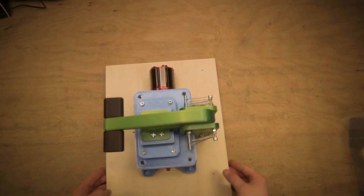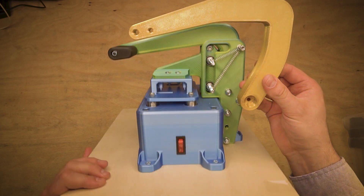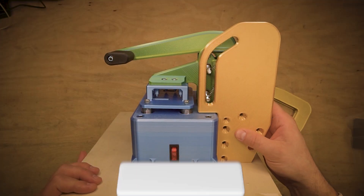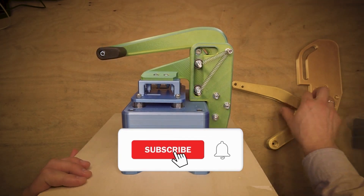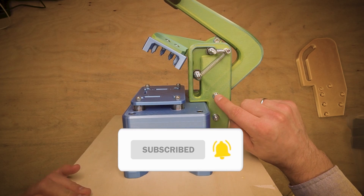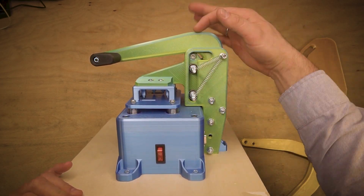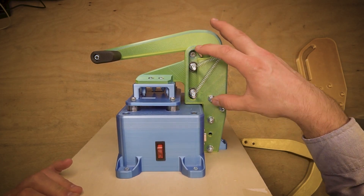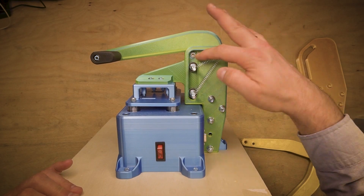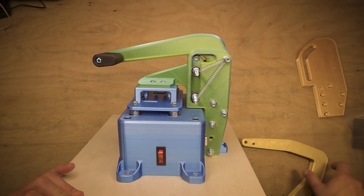There are switches here as well. Our topic today is to change the entire mechanical part — the new rails, the new cam. The problem was misalignment of the axis of the cam handle and the pressure unit upper point with the bearing inside. They should be aligned in one line, but currently they are not, which is why we have unwanted force causing issues.